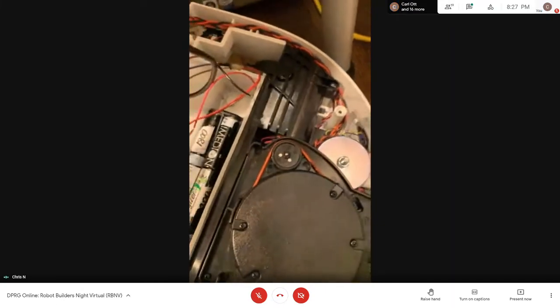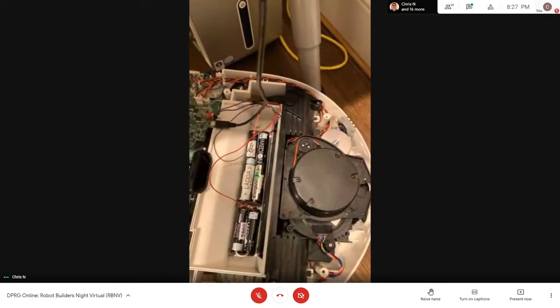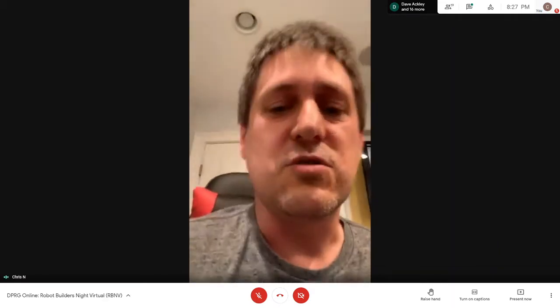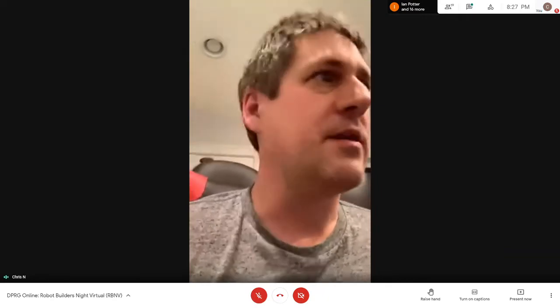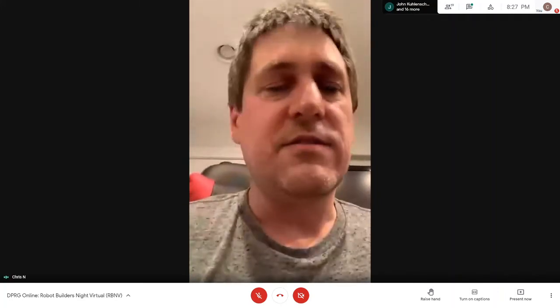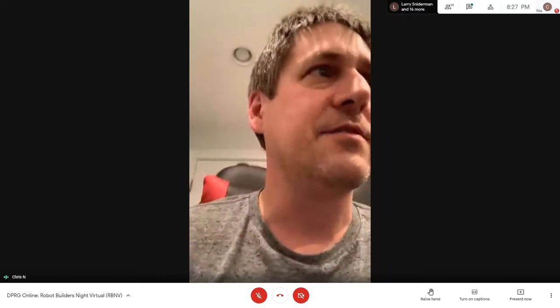And so I'll spend a few more hours on it, at least to a point. I want to get it to a point where I can remote control it. The only challenge, like I said, is really the fact that I can't just control the two motors independently, like on any other platform. That's one problem. Is that interface USB or serial or whatever? Is that interface an ASCII interface? Yes, it's meant for interactive use. It's meant for humans to use, but with a little bit of Python code, the data comes back in ASCII. It's straightforward to parse, and so you can kind of treat it as an API. It just has a few limitations.